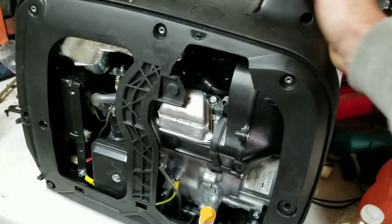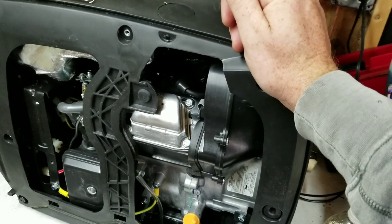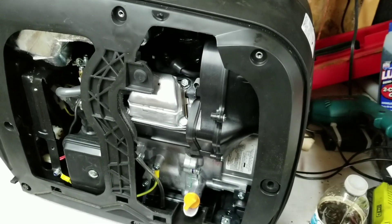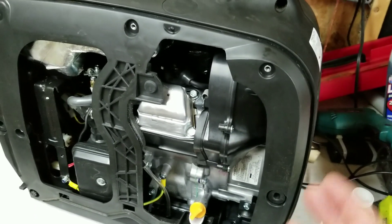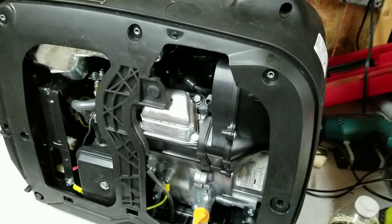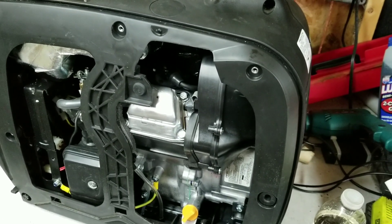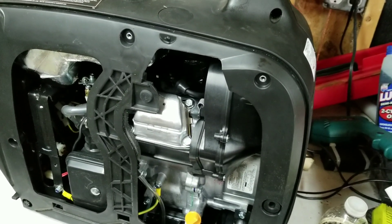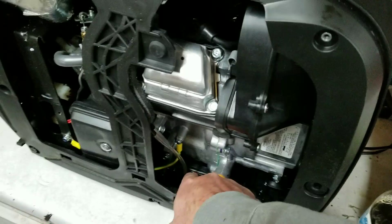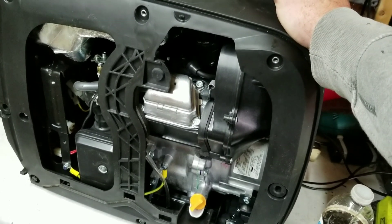There's a little bit of a whiff of fuel in the oil, so I'm thinking the rings — they didn't use the best rings in this. But still, I'm happy with it. I'll be honest — I was going to test it, call it a pile of shit, and take it back, but it's actually surprised the hell out of me. I think this might stick around in my shop for a little bit because it actually works very well for what it is. The biggest complaint I have is the plastic bottom — it eliminates you from being able to throw this in the back of a work truck and bang it around like you can with the Hondas.